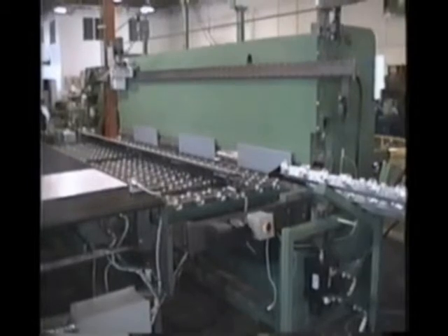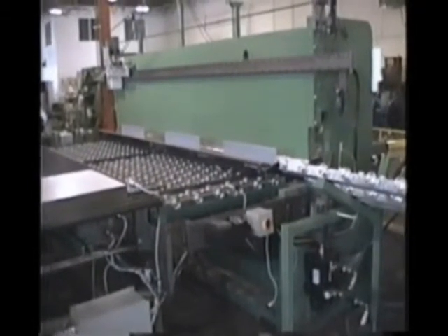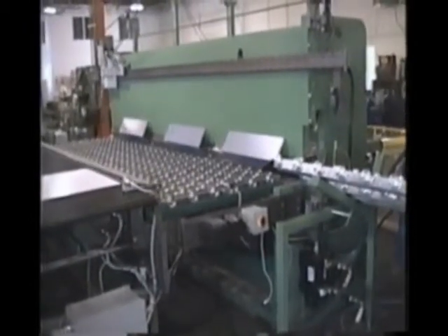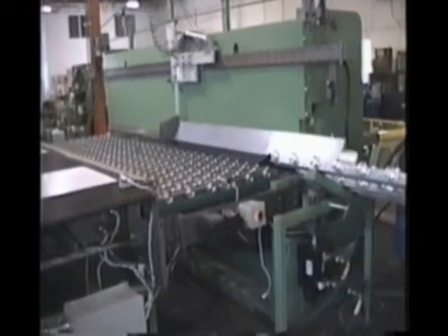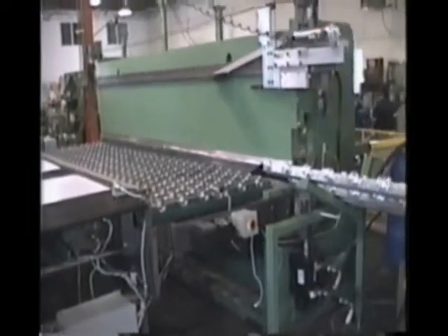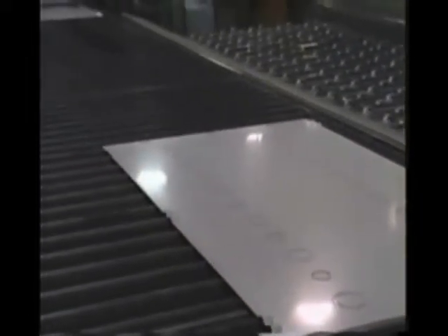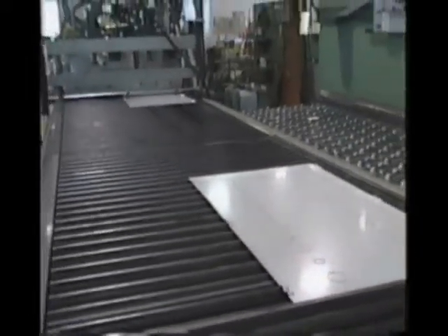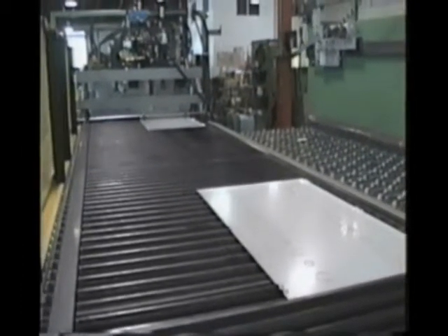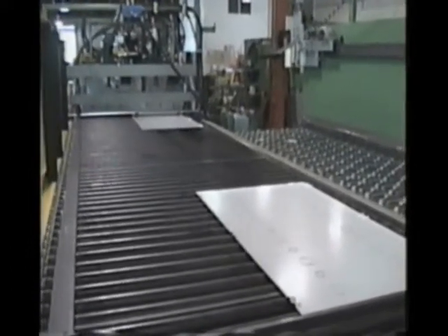The forming system is designed to form the pre-punched and cut-to-length parts into a variety of square and rectangular wireway housings ranging from 2.5 by 2.5 inch to 12 by 12 inch square or 12 by 18 inch rectangular housings. The programmable press is designed to form 3 parts at a time for up to 3-foot-long parts, 2 parts at a time for up to 5-foot-long parts, or single parts 6 to 10 feet long. The forming system handles a wide range of 14 and 16 gauge wireways with and without knockouts from galvanized or pre-painted mild steel.